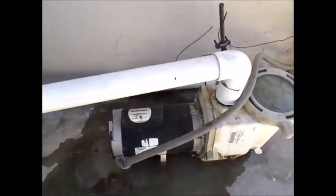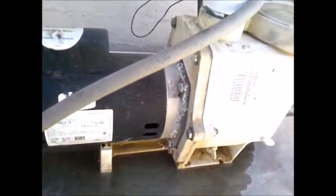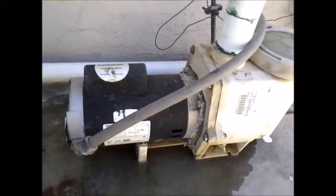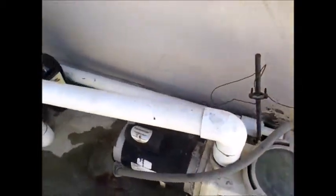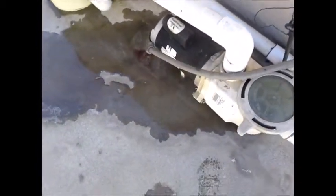You can see the pool pump is leaking water — it looks like a seal is broken. The pool is green and is pumping. The drain is missing some parts at the weir. The pipe is an inch and a half and drops down to one inch, so you've got different sized pipes, and that's not a proper way of doing things.